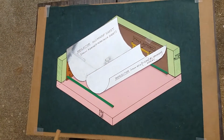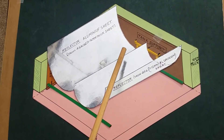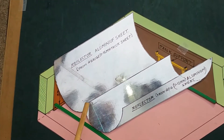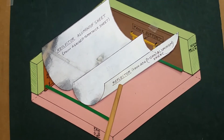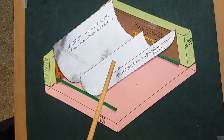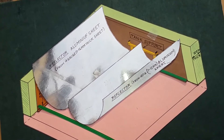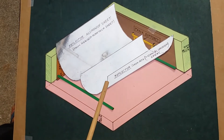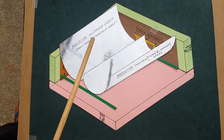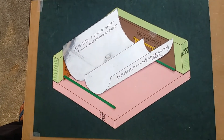You can see these reflectors — they are not parabolic. They have a peculiar shape which I will explain on the drawing. This shape ensures that at whatever angle the sunlight is coming from, all the rays will get concentrated on the tank. This is a big advantage of this water heater.